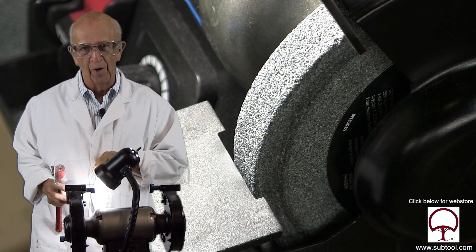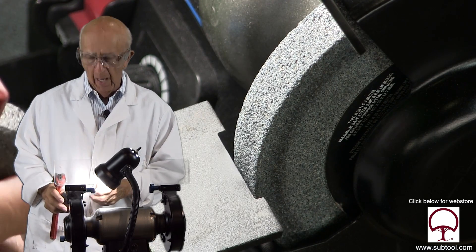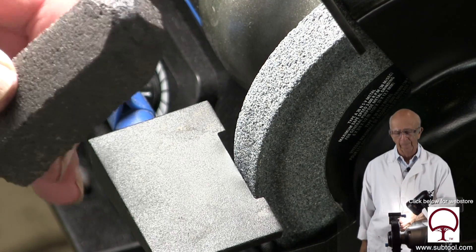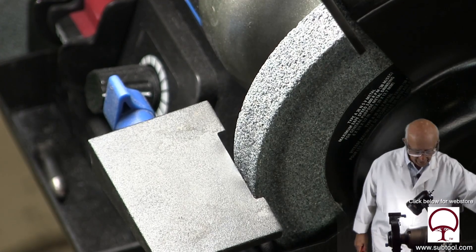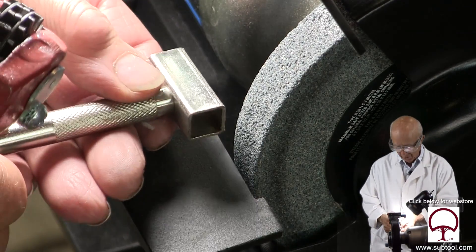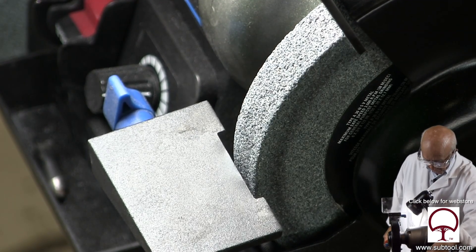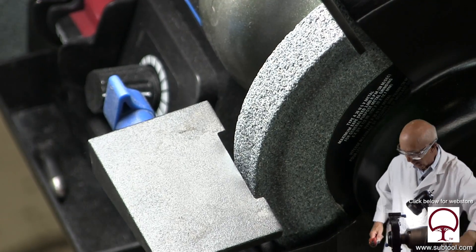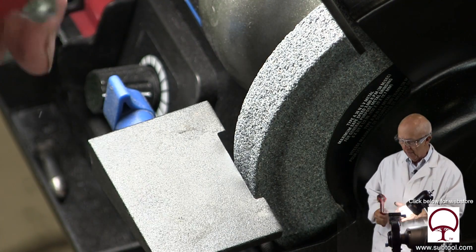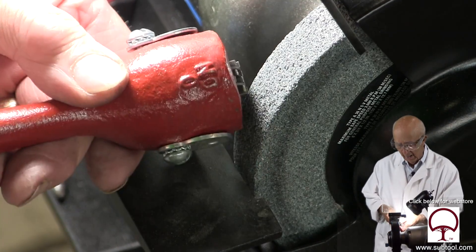The first thing we need to do is look at the bench grinder and talk about the different types of wheels. There are two grades: coarse and fine — we have the coarse on the right-hand side. There are a number of ways of dressing the wheel: one way is with the diamond, another with a piece of carborundum, another with the dresser that came with it — which has a series of diamonds built in like a pavé and gives a good flat surface, but tends to make it a bit too smooth for rough cutting. The last way, which I like a lot, is this type of cutter made by Desmond — they've been around for probably 100 years or better. These wheels actually spin, so you hold it on an angle and it dresses the wheel.